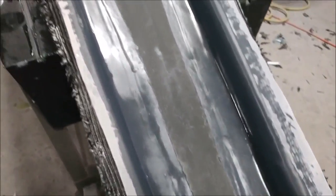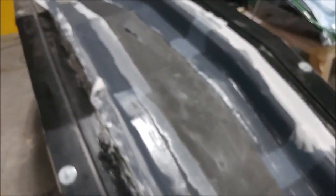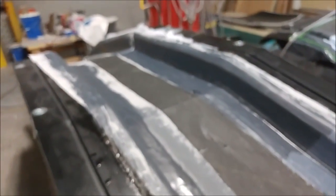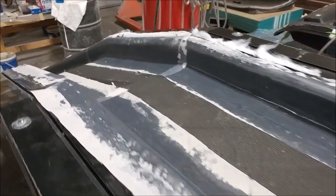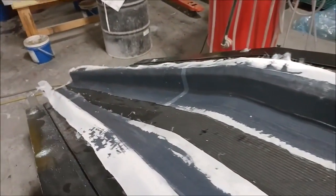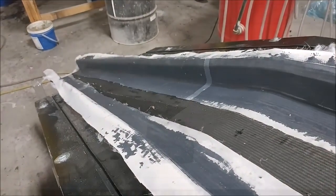This afternoon Jeff and I did a little bit more work on the spar, laying up a couple more layers in the right-angle corner on the upper and lower of the spar, along with some cabosil just to smooth things out. That one's just about ready for trimming now.